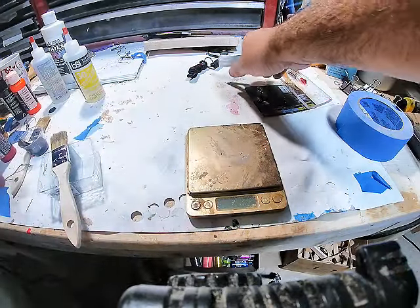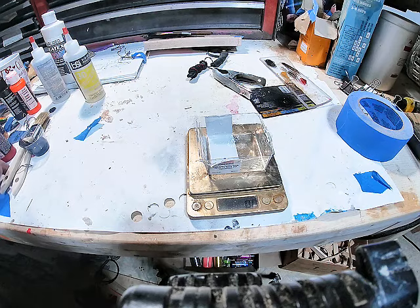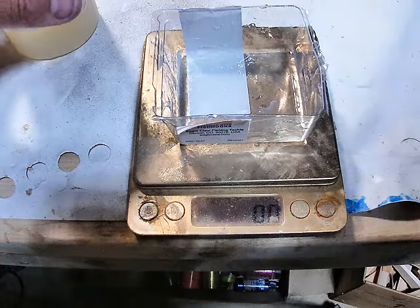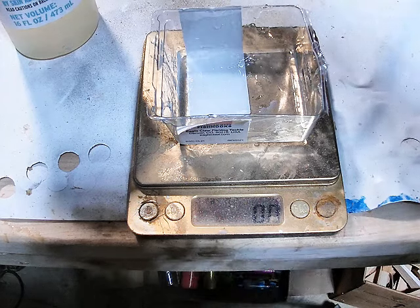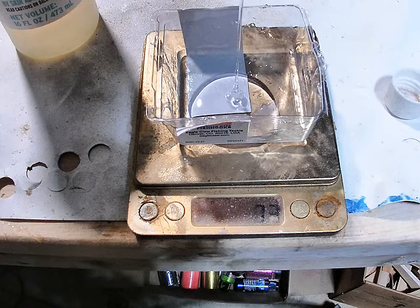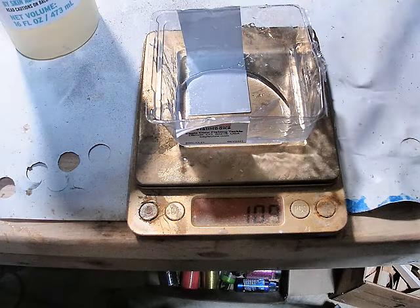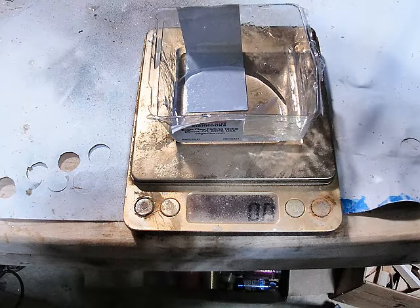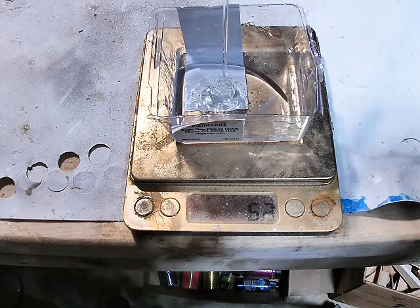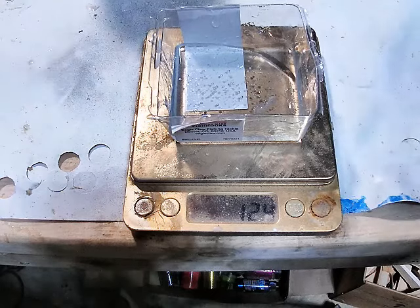Okay, so now I'm going to put on my final coat of clear. Obviously, we're using a two-part epoxy. So let's get that mixed together. Quick coat epoxy, part A and part B. It's a one-to-one mix. I usually do it in grams. We'll probably do 10 or 15. There's 10 of part A. We'll zero it out, and then we'll do 10 of part B. Oops, I guess we'll do 12. It'll harden faster. That's okay. We're gonna mix it and then we'll be back.